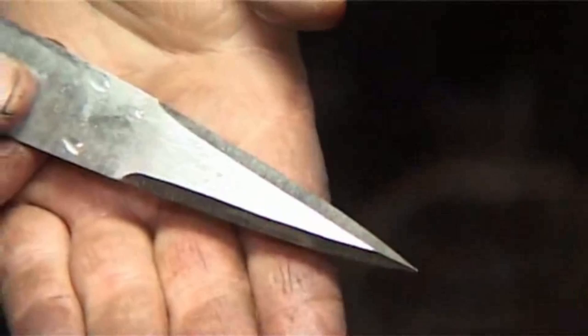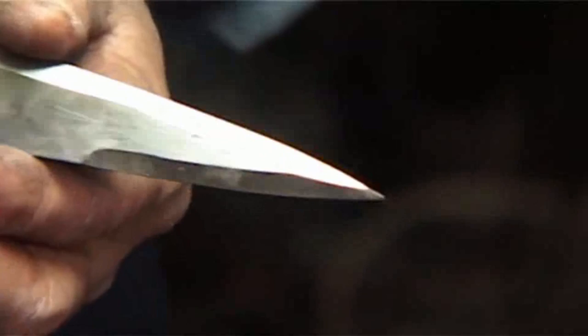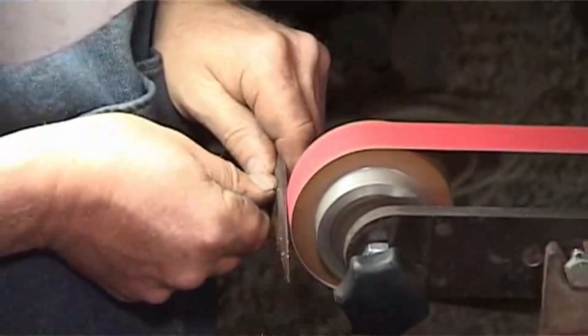All right, so they don't meet in the middle. Obviously, only right down there they do. All right, my cutting edge thickness is over a millimeter. You're not making your edge too thin. Rather do more grinding at a lower speed after heat treat. All right, so I'm just going to raise that grind just a little bit. And I can kind of see the line in this light.